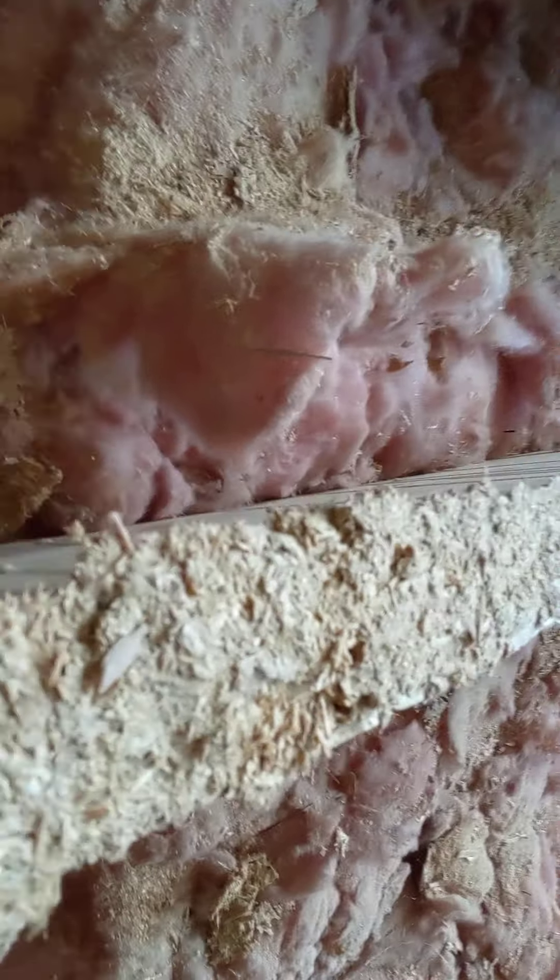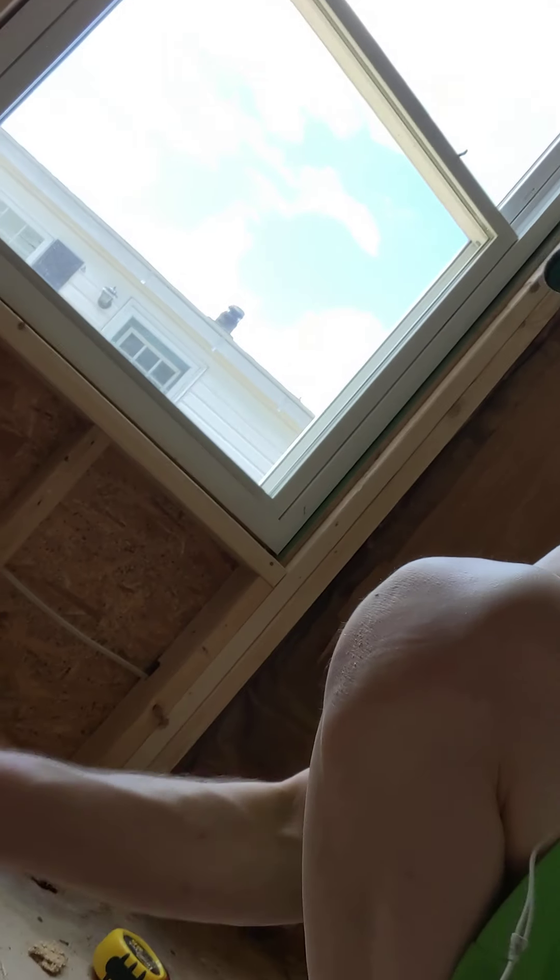So we're replacing it with three-quarter inch plywood, which is really good. But the thing we were unprepared for was this — look, it's all glued down and it's been stapled with a bazillion staples, which I've slowly been pulling out. These are some of the staples that were in there.